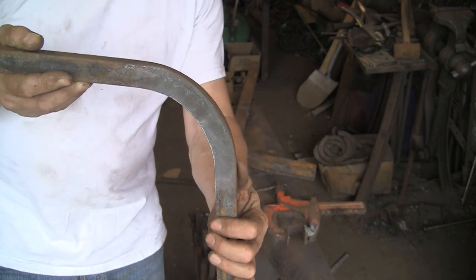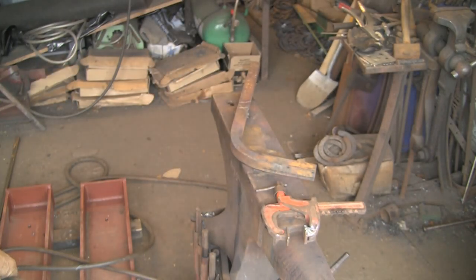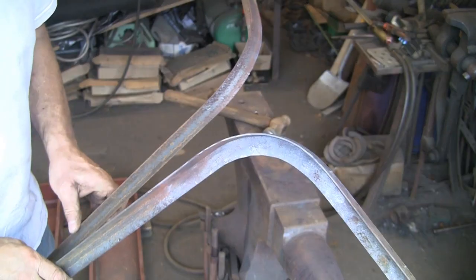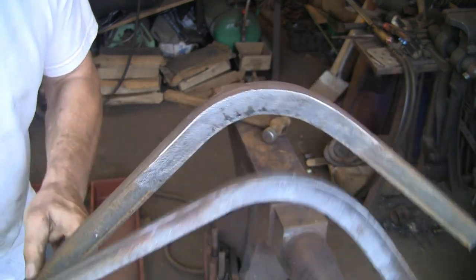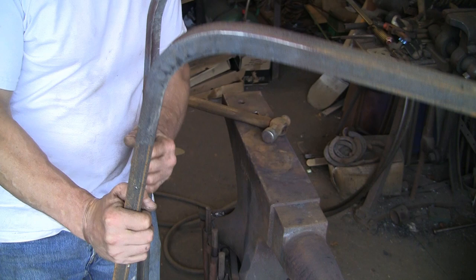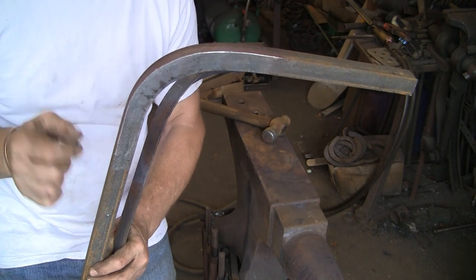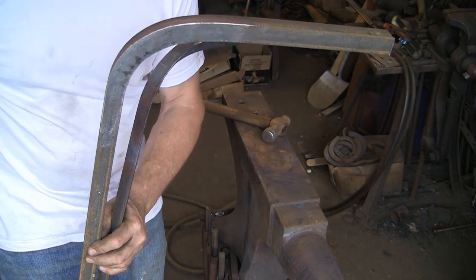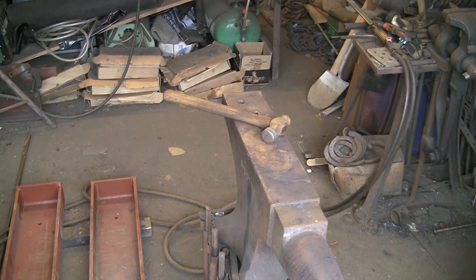You've got some bits of steel joining it to the other piece on the other side, then you clad it over and that'll look a treat. So now I've got to go and make another one to make a pair. Right, so I've now got my pair. That jig obviously worked fairly well because I've pulled the other one round the other way and they're pretty much the same. Where it's been puckered up, it actually doesn't look too bad, and they'll obviously go away from each other — I think it's about four foot wide, three foot six, four foot wide. Any little inconsistencies won't matter. Then clad with the sheet, folder the edge over, just leave about three eighths of an inch, tap it over the edge with a soft mallet, pop rivet around the top and down the sides — and Bob's your uncle. So there you go, that's one of my jobs for the day. Thanks for watching, catch you on the next one.